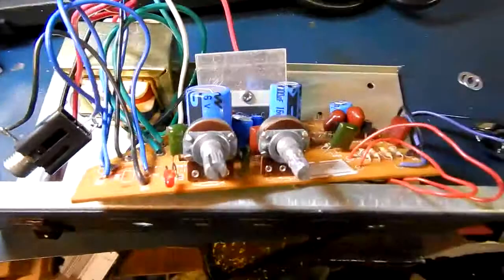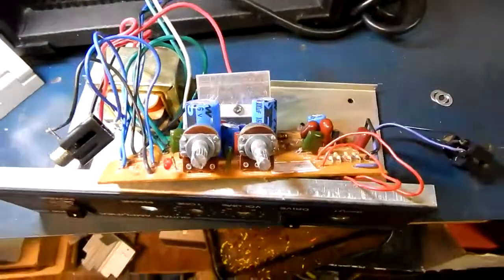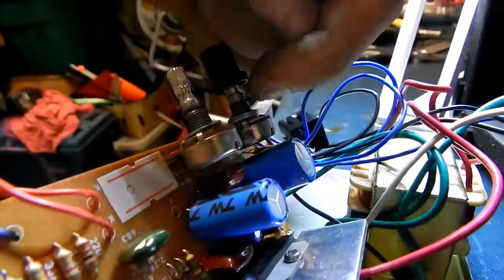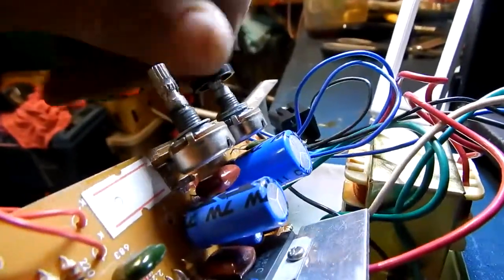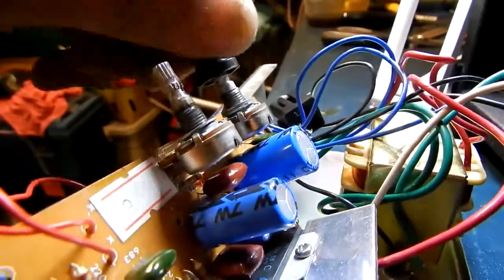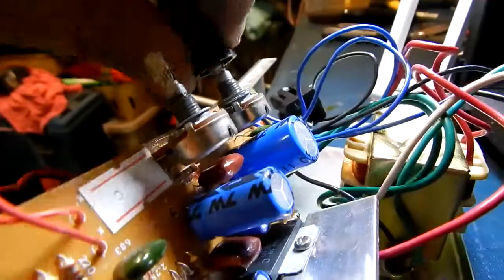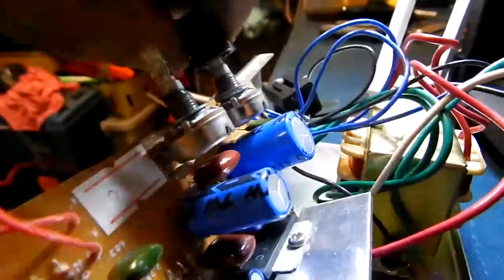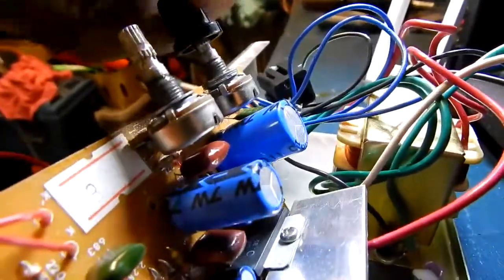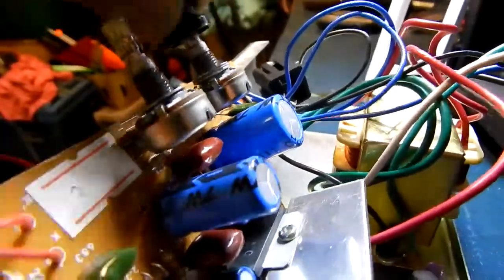I don't really care about the amp as long as we get the volume going — at least you can turn it down. You can oil them. This one here was pretty tight and I dropped a little oil in between the shaft and the main part of the pot and it's loosened right up. Every turn it gets better and better, so I don't have to change the tone pot. See, it's loosening up really nice. The more you turn it the better it gets.